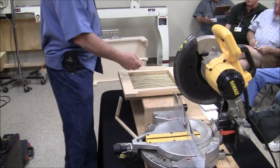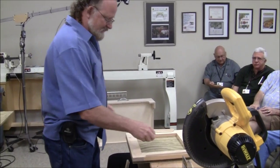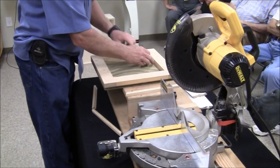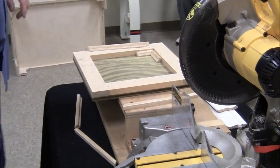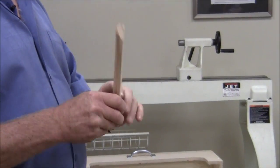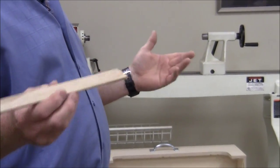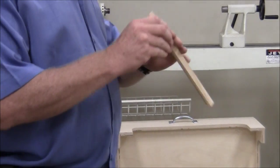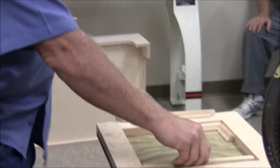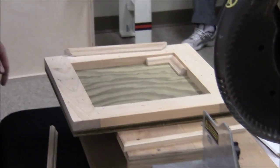Especially on a door if you've got a lot of panels, I usually just cut a couple pieces of scrap and just kind of throw them in the corner and make sure. Especially with different moldings — this molding is pretty small and flat on the back side. But as you get into bigger molding, wood doesn't stay stable. It moves. So sometimes you get a roll on the back, and if you put it in there and it needs to roll one way or the other, it's good to know ahead of time.